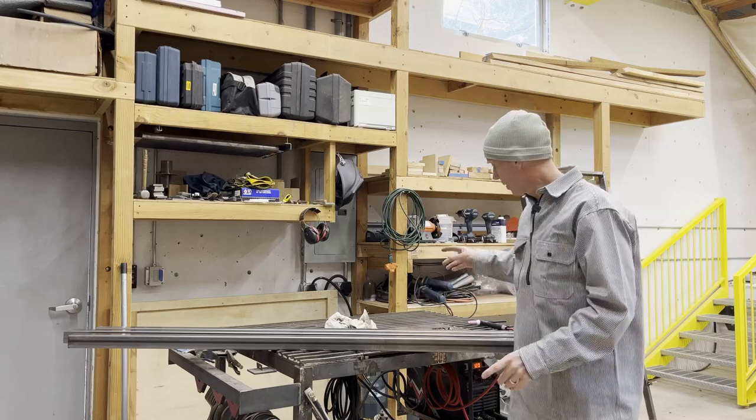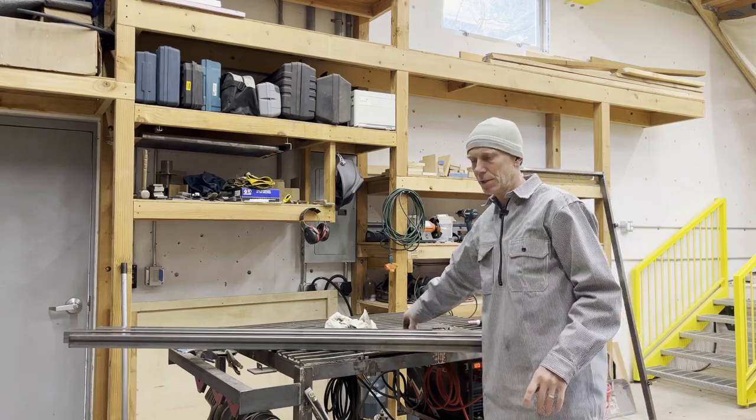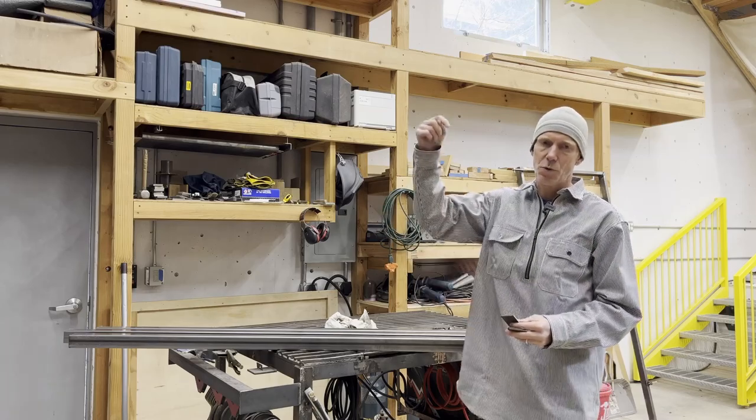So these next three, the first thing I'm going to do, if they're cut out to the length, they're going to be about 6 feet tall, 6'4". And then I've got little squares. I'm just going to put little caps on them and weld those on, just weld up the top so that water doesn't pour down in there when it rains.